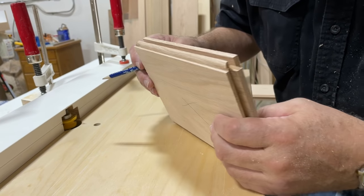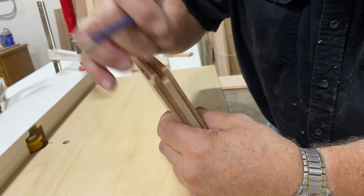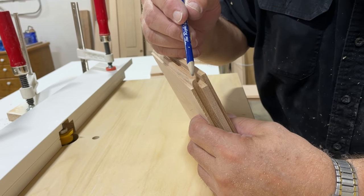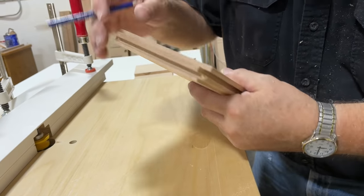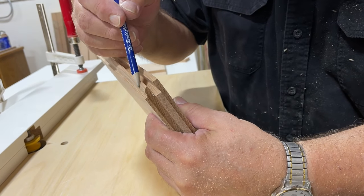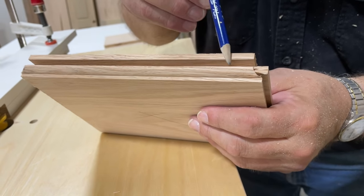I wanted to point out just exactly what we accomplished. If you look at the end here of my board, you'll see the little flat spot that we just jointed on there, that 32nd of an inch. So our bead isn't perfectly round, it's just flat on that one edge. We turn it around here to the edge that I've run, and we've now put a full bead smooth on there. But look what a nice edge that gives us on the edge of our bead.